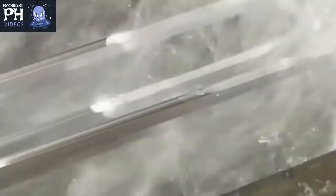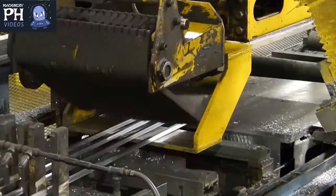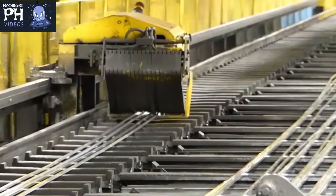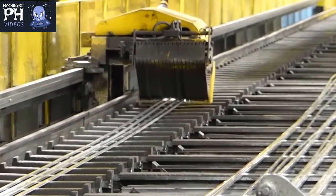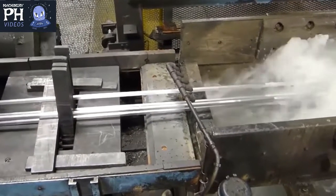This is called quenching and is done to uniformly cool the extrusion at a controlled rate to establish intended mechanical properties. A device called a puller grabs and secures the hot extruded length and guides the profiles down the runout table. The puller and runout table, a sophisticated mechanical process that uses conveyors and belt systems, is synchronized to the speed of the extrusion press.